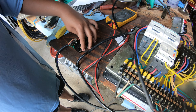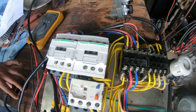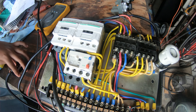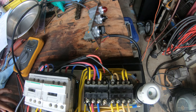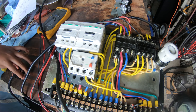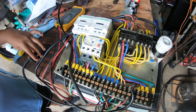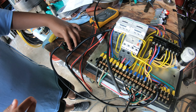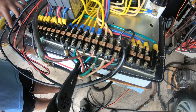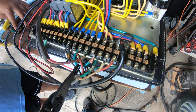Go ahead and press the forward button and hold it. The forward contactor's in. If I lose power, kills it, and while she's holding it, the whole system's dead still and it's not working. So I think it's working. Go ahead and release — as soon as she releases it, which basically turns the switch off, the power comes back on and we're back up and live. Go ahead and push it again, hold it down. So now, testing — I push the foot pedal brake, which opens the normally closed connection, kills the system.